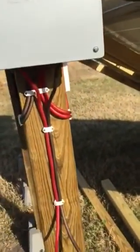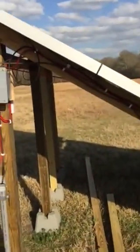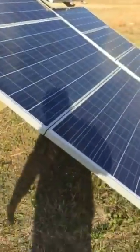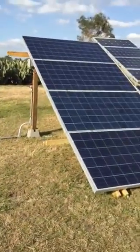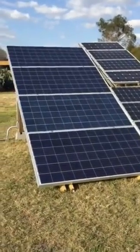I have a combiner box here. This box feeds down into a line that goes to the ground so I can drive over it, and it goes into the house where it's fused inside a battery box. That does the work of getting electricity into the home instead of having a bunch of heavy-gauge wires running in with positive and negative separately.